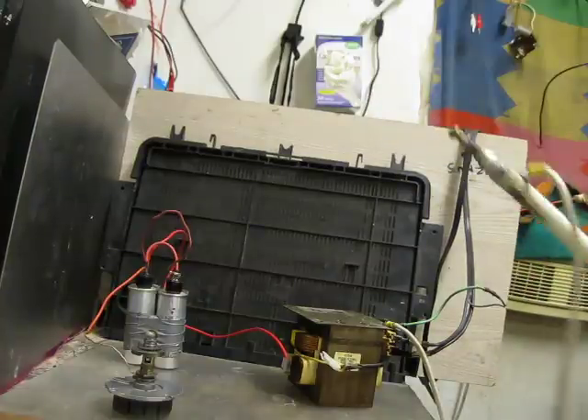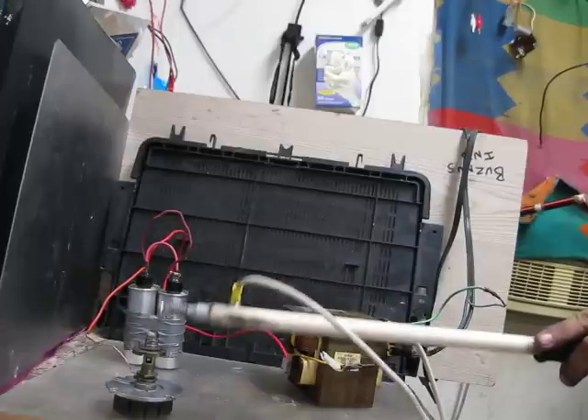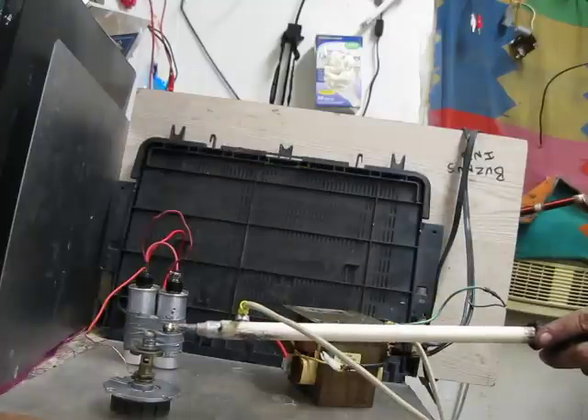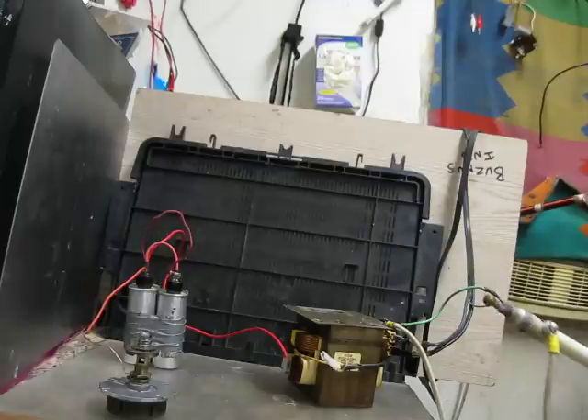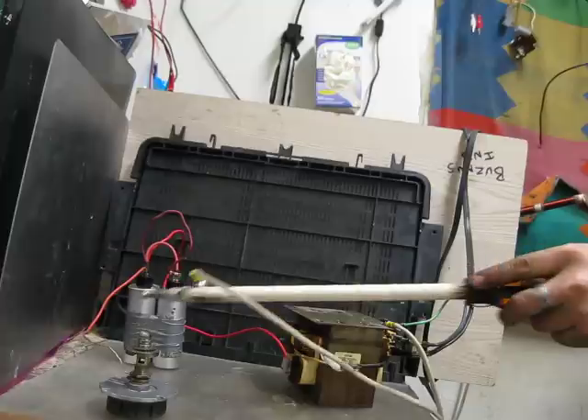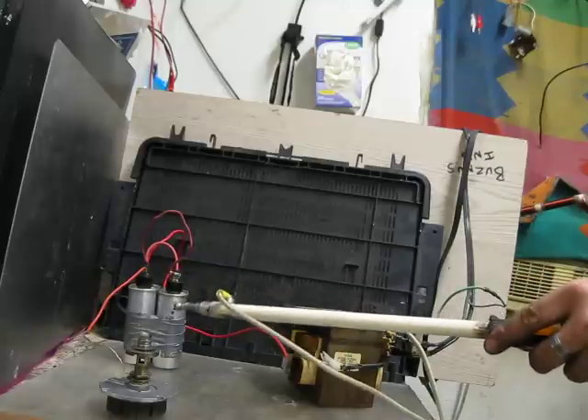I have it set to blow at 15 amps instead of the normal 20, so I don't have to go out to the circuit breaker. If you've got a little surge protector with a trippable fuse that pops after a couple of minutes and you can click it back in, I'd recommend it. Otherwise, here's to hoping you've got good AC and good circuit breakers. The reason it went from just a tiny little pathetic static shock, basically, to that arc isn't because of the extra capacitance - it's because of the resonance.